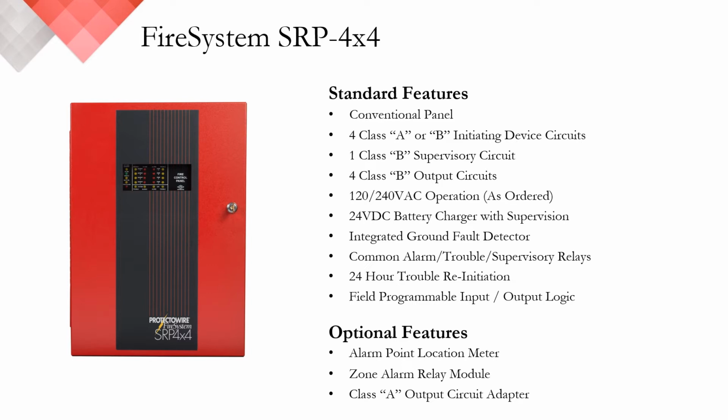While that's an impressive length, I caution the audience that we do not typically recommend installing that length of detector on any single zone. If there is a fault condition, troubleshooting almost 2 miles of cable, or over 3 kilometers of cable, can be a service nightmare.